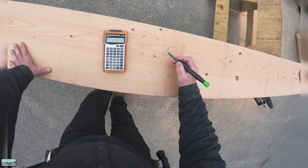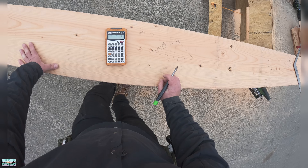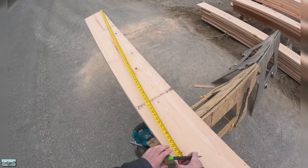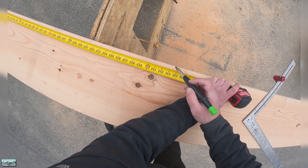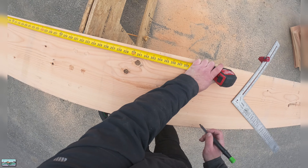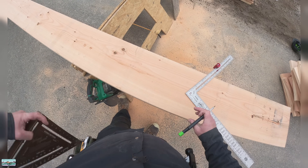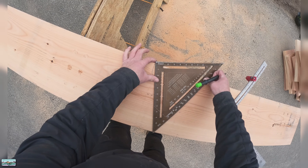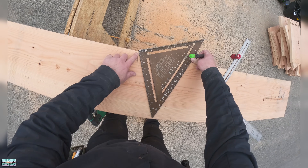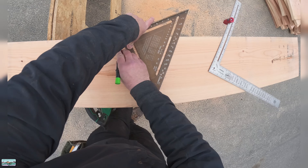My run is 18'9" with a 5-inch pitch — that slope gives a diagonal of 20 foot 3 and 3 quarters from my plate to the edge of the ridge. Because I'm going to add a heel stand, I'm measuring the top of the rafter. So 20 foot 3 and 3 quarters — pivot point goes right on my length. I always use my middle finger to incrementally adjust it. Pivot 5 on the 5/12 common — this is my plumb cut.